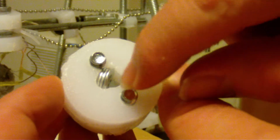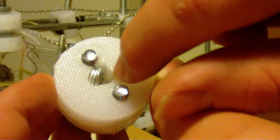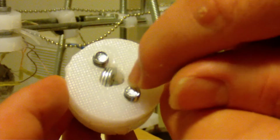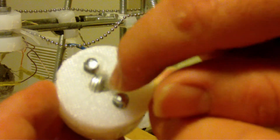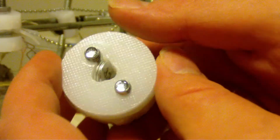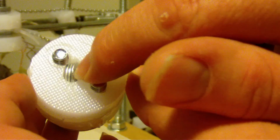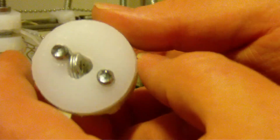See those washers, and then you want to make sure that the hole in the middle is fine. I know you can put this like this or like this, but you want to make sure that the center part, which is mostly a circle, is fine, and that the washers go here up to here. And if there's any amount of play in the motor at all, even enough to wiggle it just that much, you want to put another washer in there. And you should really have to push hard, put a lot of pressure down on there to get the motor shaft inside of this. And the flat side goes along here, and the metal washers help provide the strength so that when the motor turns, it turns this and it doesn't wear this out.